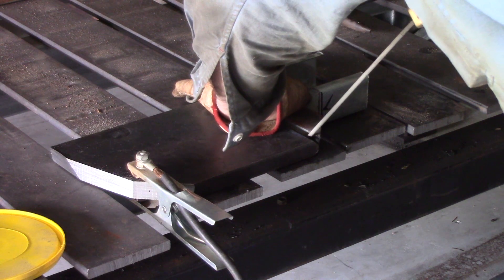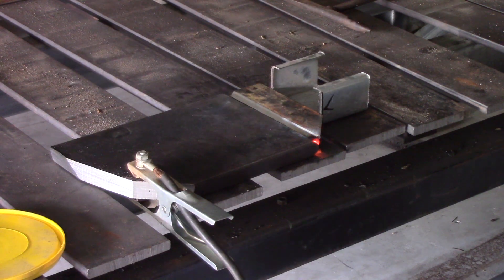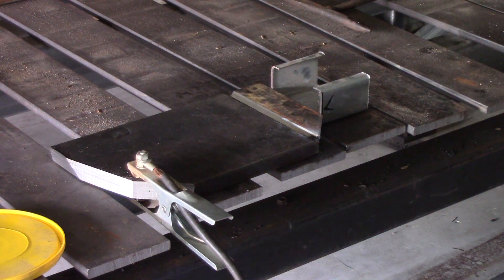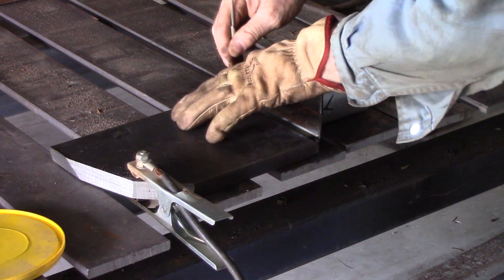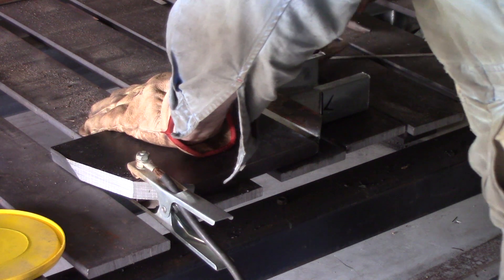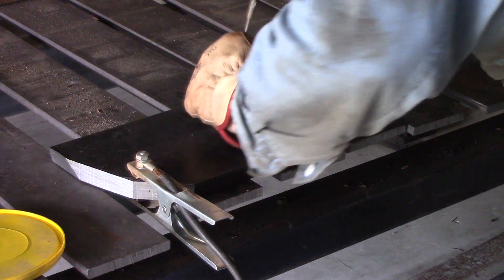So this is part 008, the horn that goes at the end to hold the ram. I couldn't get a big enough piece of metal to do it in one hit, so I'm going to have to make it in two pieces and weld it together. Because this metal's an inch thick at 25mm, it's going to take a little bit of welding, so I've given it a really good bevel down on both sides.